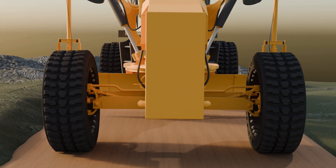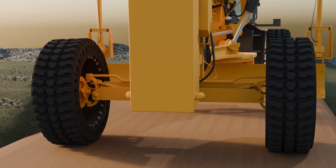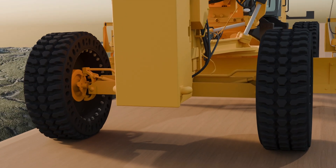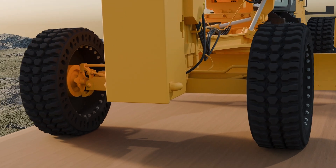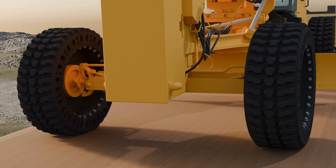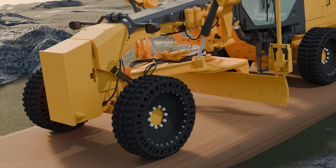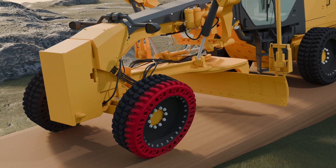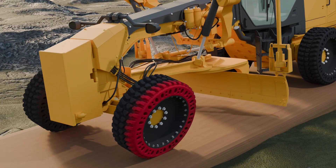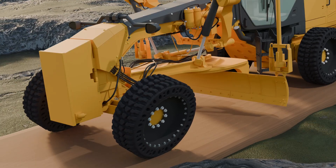The team is beginning by observing performance during standard low-speed road grading at speeds between 2 and 4 miles per hour. During this test, they are watching the front tires of the grader as they lean fully left and right depending on the angle of cut the grader is attempting. The tire lean puts additional stress on one side of the tire rather than the other, which could potentially damage the tire or cause premature wear.